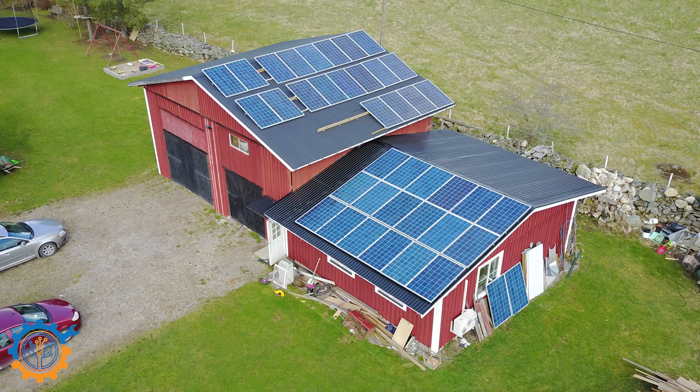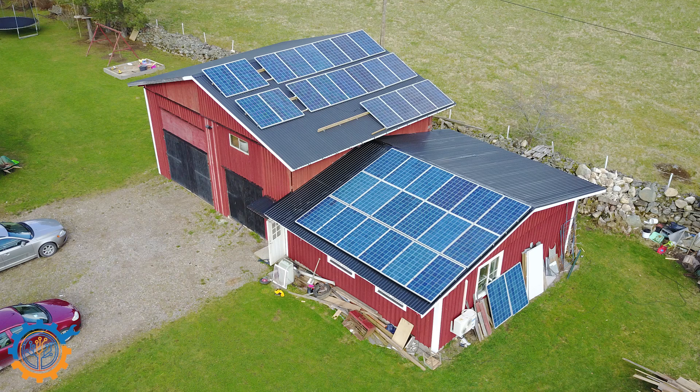As you can see on the roof, I have chosen to do it in two different angles, and that's because it takes up quite a lot of room to have roughly 40 panels on the roof. The reason I went with poly over mono crystalline is that when I bought the poly panels they were almost half the price compared to mono panels in terms of money per watt. So that's why I went with poly, and they have been working pretty well for me.